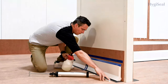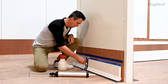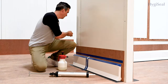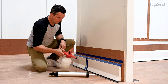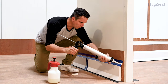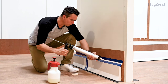When the vertical joints are filled, the smoothing can be done. Spray joint finishing liquid only on the smoothing tool and your hands to prevent excess HygiSeal from sticking to it. Spraying joint finishing liquid on the joint at this stage can give issues in the future, as the liquid prevents good adhesion in the places not yet covered. With the straight side of the smoothing tool, remove the excess HygiSeal from the joint and create an even joint over the entire length. Place the tool at an angle of 45 degrees and apply just enough pressure so that a little HygiSeal remains on the tape. By smoothing under this angle, you press the HygiSeal into the joint. Don't work too fast because then you will pull the HygiSeal out of the joint and create hollow and weak joints. You can smooth the same area several times to ensure you get the desired result. Avoid building up too much excess HygiSeal on the tool, as this will fall and cause unnecessary cleaning.